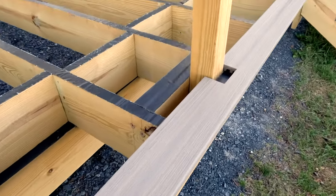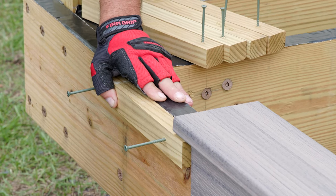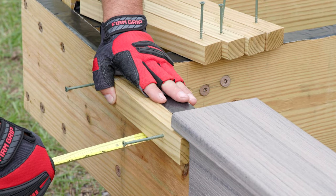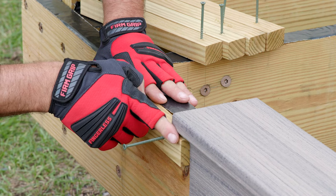To simplify cutting around these posts, I pre-cut and notched the first two boards. Before I start measuring and cutting the first board, I like to install some 12 inch pieces of scrap wood to serve as blocks, which help me maintain a consistent overhang the entire length of the board. In this case, the blocks will be an inch and a quarter wide.